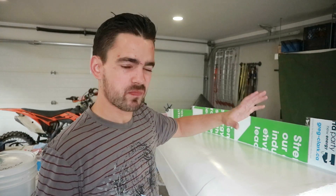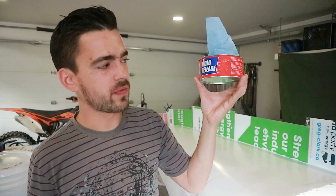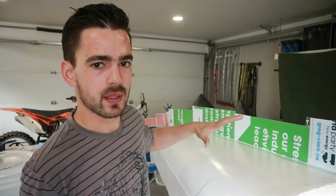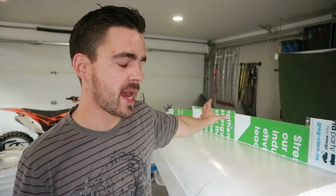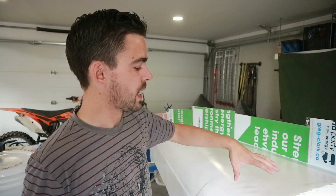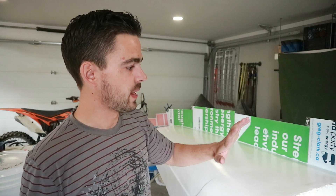We're back. The DAP is cured up overnight, so now our flange dam is fairly solid. I don't want to mess with it too much, but it's good enough for now. We're going to lay a bit of our mold release wax on the buck itself. I did put a light coat on the dam and I'm not going to buff it off — I'll just leave it — but we will buff it off of the buck. So we'll wax this up and then start on the PVA step.